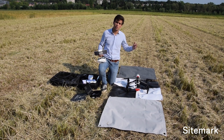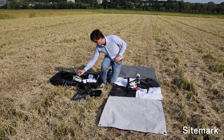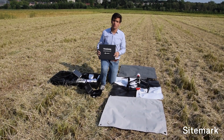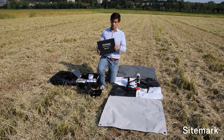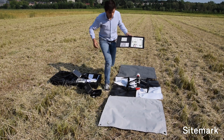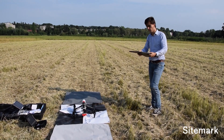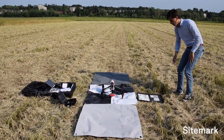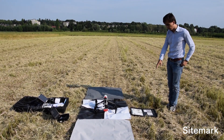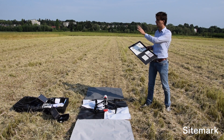If you need more than one battery, the drone will come home and you will be able to swap the battery and click continue. Important before you click takeoff — after loading the whole flight — is to use the calibrated reflectance panel that came with the kit. This is used to calibrate the camera in the MicaSense. You will identify where the shadow comes from, drop the panel making sure the sun is in your back but you are not creating shade on the calibration panel itself. Everything is also written inside the panel in case you forget, and in the manual.